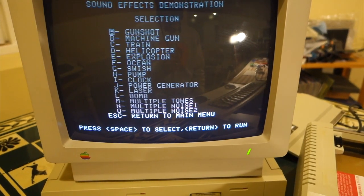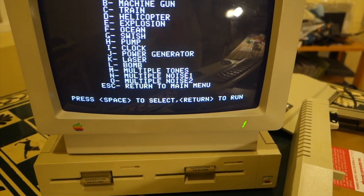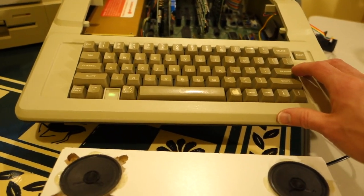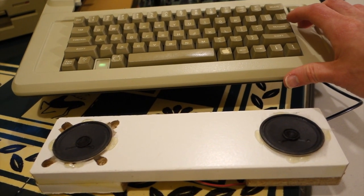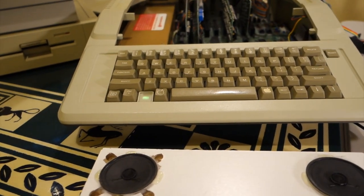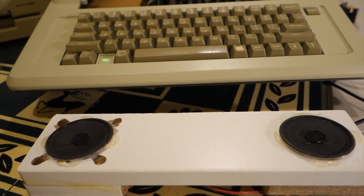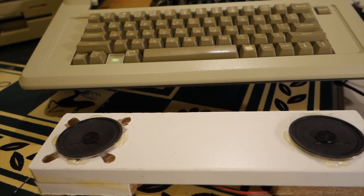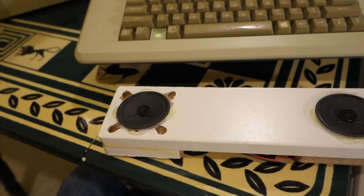The last thing I want to try is the sound effects demo that comes with the Mockingboard itself. You can download this disc image from Asimov and it comes with a variety of sound clips including some songs. For the sound effects, the first one called gunshot should come out of the left speaker — which it does — and then the next one, the machine gun, should come out of the right speaker. So it looks like everything's working well. The only minor problem now is that the sound from the Apple IIe is actually coming out of the right speaker, which is a little weird. If I have time, I might go back and try to reverse the input from the logic board so it feeds into what is now the left channel, since I'm used to the Apple sound coming out of the left side.